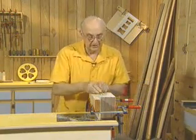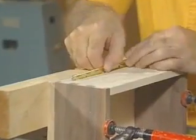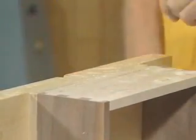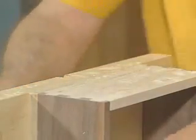Now, maybe you can see in here, see the gap that I've got on either side? I've got a good 1/8 of an inch there extra, but I got good length on it, so it'll fit down in there fine. Now what we need to do is set up a different operation, and we're going to put a slot cutter in and cut a 1/8 slot in here. It's not that it's a little tricky outfit, but it is a little bit different to do.